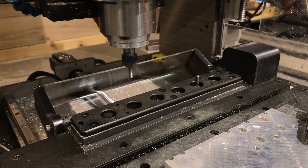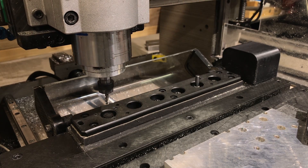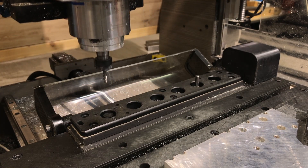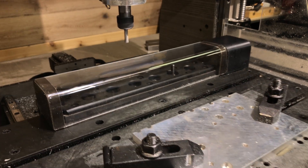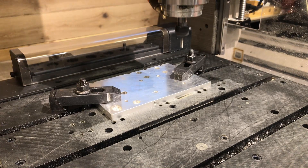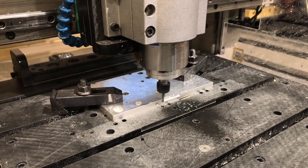I've set up some scrap aluminum. This is an 800 watt spindle. We're taking a depth of cut of 4.75 millimeters — it's a 3/16th inch cutter, so I'm taking 3/16th depth of cut and a 60 thousandths optimal load. Every time it moves over it's cutting 60 thousandths, or about a millimeter and a half, and the feed rate is 50 inches a minute, or about 1270 millimeters per minute.